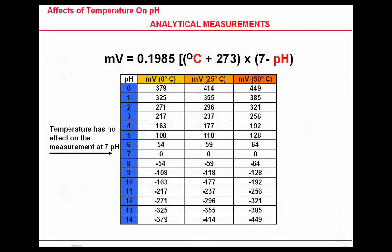Temperature is important here. Going down the middle of the column, you see zero millivolts at pH 7 and 59 millivolts in either direction as it moves up to pH 8 or down to pH 6. But as your temperature changes — let's say it goes up to 50 degrees C — seven stays constant, but your pH 6 will generate 64 millivolts instead of 59, and pH 5 will generate 128 instead of 118. That is strictly a function of temperature.